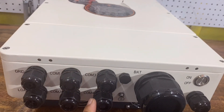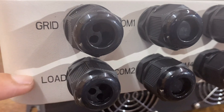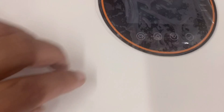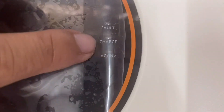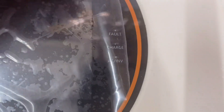This power inverter has two separate ports for the AC — the AC input and output. The grid port is for the AC input, and the load port is for the AC output. It also has an LCD monitor where we can see and set parameters of the inverter. It has three indicator lights: one for the inverter, one charging indicator, and one fault indicator.